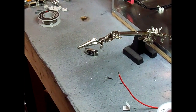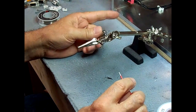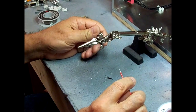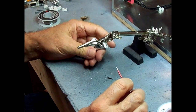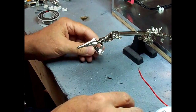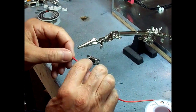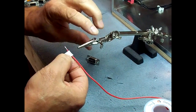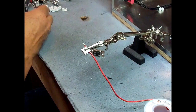I'm getting ready to solder the wires onto the DB9 connectors, which will mount in the front of the box for the cables that go to the stepper motors. Four wires per motor, so I'm going to use the bottom 4 pins on the DB9s. So we'll start tinning the wires. Set my soldering iron hot enough.